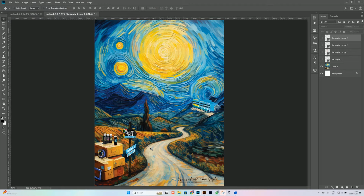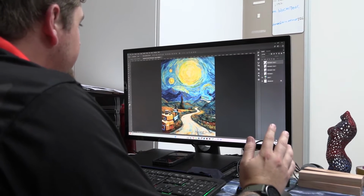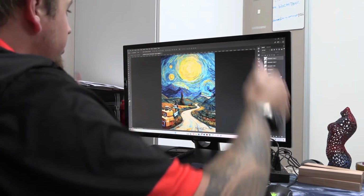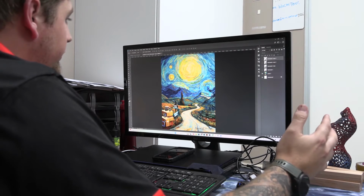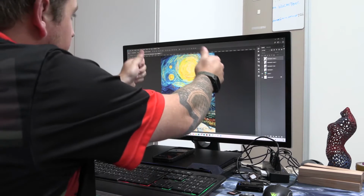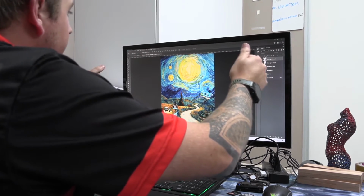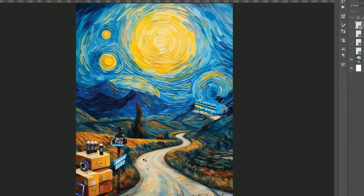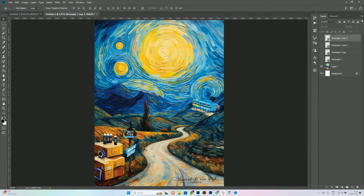So the first thing we need to do is section this off according to the size panels we need to apply the wallpaper. Now, you always want to do wallpaper in lengths from minimum width, the panels that you're going to use, 800 being minimum, and then you can go all the way up to maybe around 950, but try not to go 1 meter wide, because when you're actually holding up your panel, the wider it is, the more difficult it is to actually place it, and the longer your arms are stretched out quite wide, which is not easy when it takes about maybe 10 minutes to do each panel.